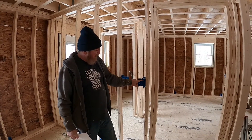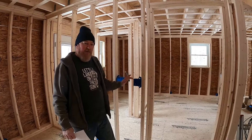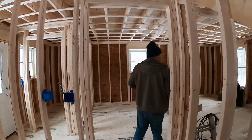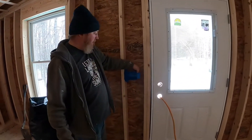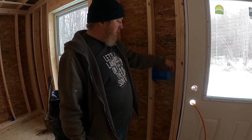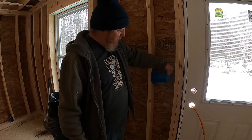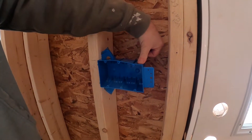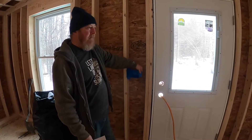About these boxes: when you hit the nail and pull it up a little, you'll see the box is folded up in the middle. Just tap that with your hammer and the box will straighten right out — do that before drywall goes up. If you have more than a two-gang box, like a three-gang box here, it can be a little floppy. We're going to put a block of 2x4 in here to hold it where it needs to be and make sure it's level. The drywall guys could deform it easily, and then when you come back to put devices in, you can't get the cover straight.